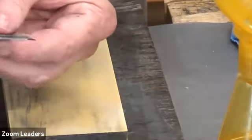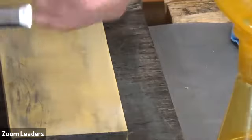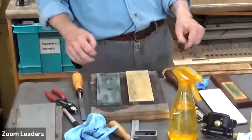Round off. That, or it's just not sharp. It's not bad, but it should be really sharp and just move through wood with hand pressure only, since you don't tend to hammer paring chisels. So that's going to need a little bit of work.